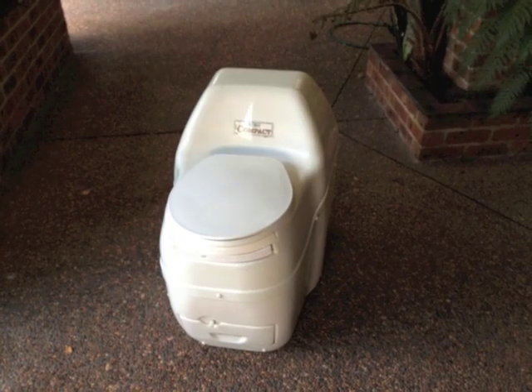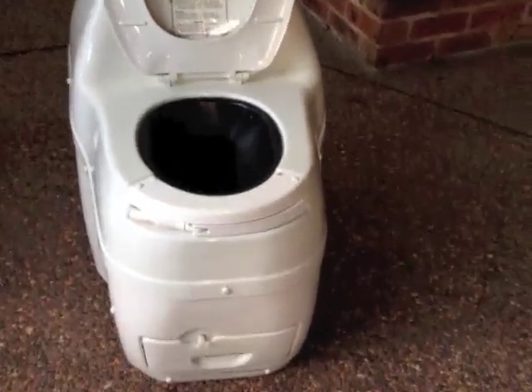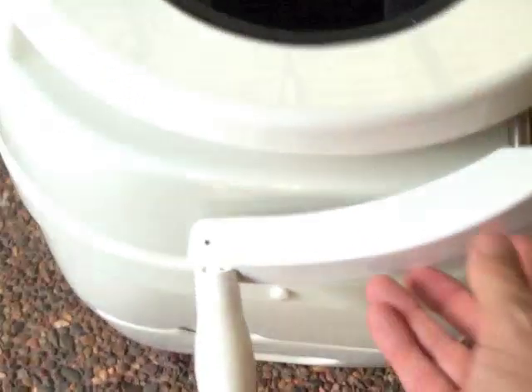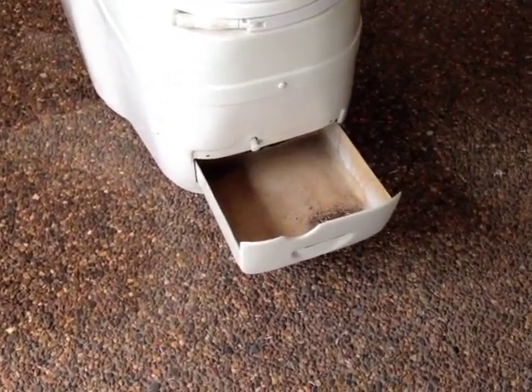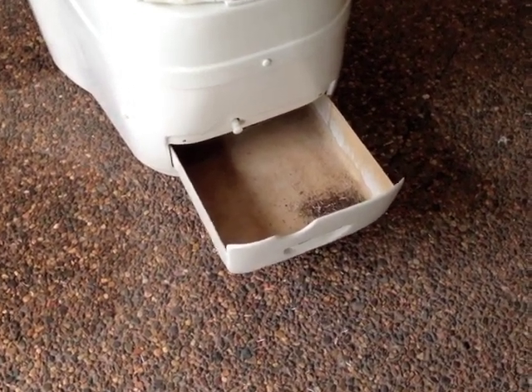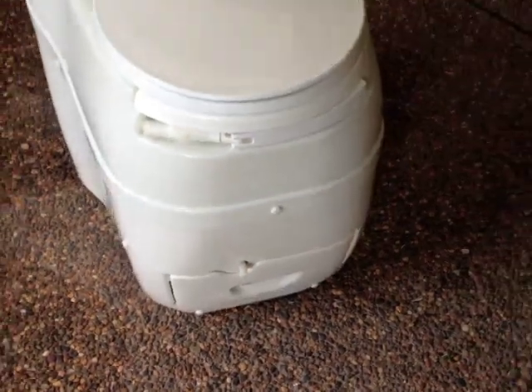Here's how it works. You go to the toilet, you put your loo paper in, you then take a handful of sawdust and throw it over the top. When you turn the handle, it spins the drum, which moves what you've just put in the toilet to the back into the composting part of the chamber. This will quietly compost and reduce down to a much smaller volume. After a few months of composting, you turn the handle in the opposite direction and it takes the small processed soil and puts it into the finishing tray, where it sits for another month or two, then gets taken outside and buried and put in the garden.